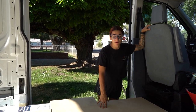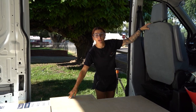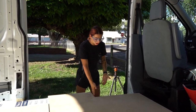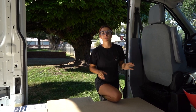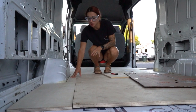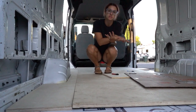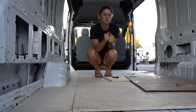This piece actually came out perfectly — a lot better than we expected. We thought we'd have to shave off a little bit on each side, but it's working out great. On each side we do have a little overhang over the step. One side is longer — we're going to have cabinets coming up to about there with an entryway. The other side, where the overhang is, is going to be a seating area with a table and chair. Our plan is to flip this piece, trace it, recut it for the other side — it's going to be a really nice fitting plywood puzzle piece.